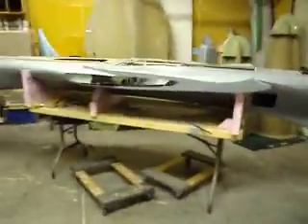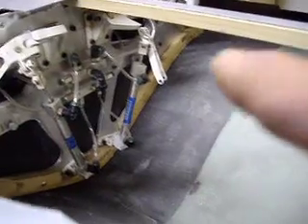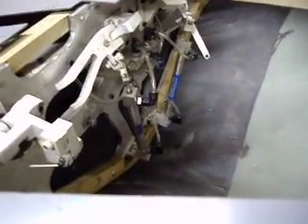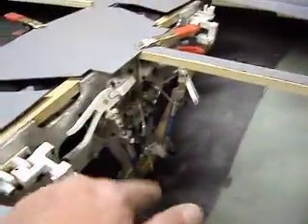I'll tell you what I used - I took a heat gun. If you want to get some epoxy loose, take your heat gun and heat it up and it comes off a lot easier. But I had to do it in little bitty spots, and if that top wasn't carbon fiber right there I never would have been able to do this - I would have torn it to shreds. I started right here on the side and went all the way around a little bit at a time, then moved it up, heated it, hammered it back in, and moved it again. Took a while but I got it loose and it didn't hurt a thing. Then I turned it and pulled it right out.